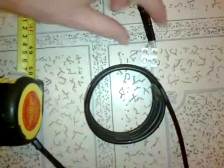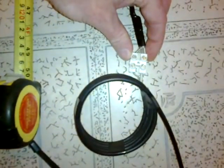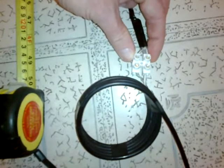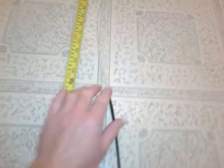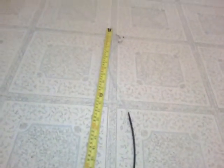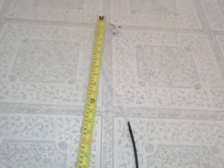I'm yet to isolate the block connector, but I might be swapping it for some other connector - not sure yet. The aerial consists of this tiny bit here, 35mm long, joined onto the first bit. The centre coax is exposed, a bit of the outer braiding is still left on there, and then the top part is exposed. I've just put on there, with an elastic band, a keyring eyelet - just so I can hang it up at the moment.